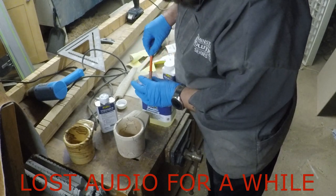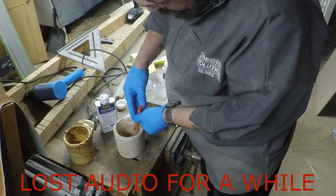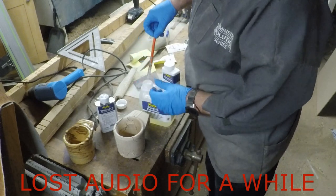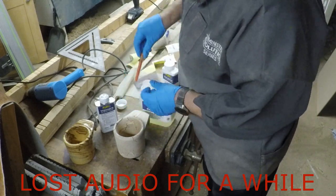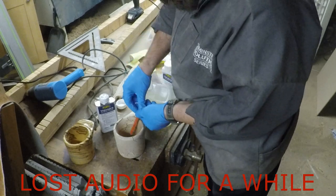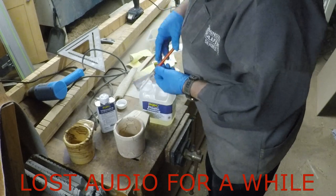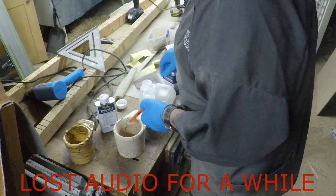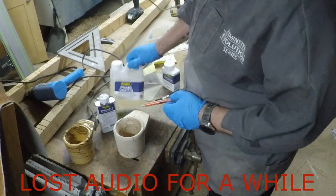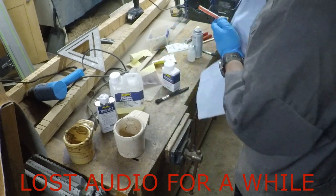It is a 4-to-1 ratio, so as you can see, I'm using 5 mil dialed out by one of my daughter's Calpol syringes, and I'm going to go with 25 millilitres of finish. That's going to be 20 millilitres, sorry, of the standard coating, and then 5 millilitres of the hardener.